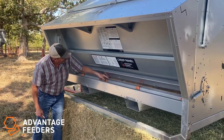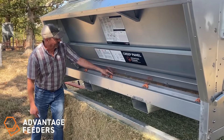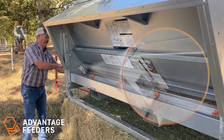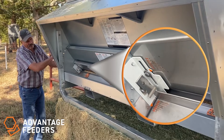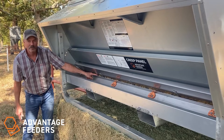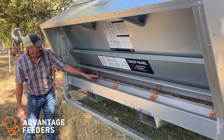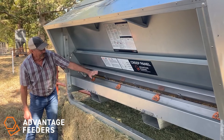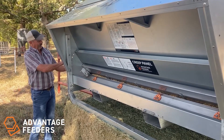So if you can see in here, that's what brings the flow. I'm going to go ahead and raise this up so you can see it one more time. That would be in the all-open position right there, which is roughly around a one-inch opening, which is going to allow for very liberal flow. As we're trying to control flow, we simply lower the adjuster.